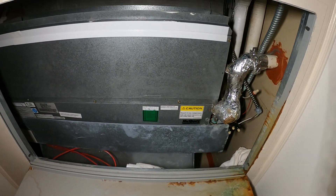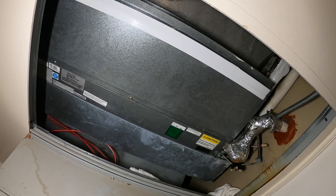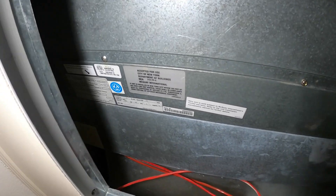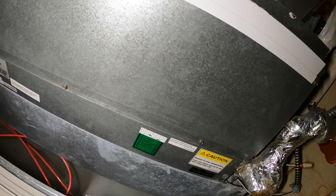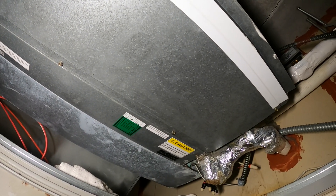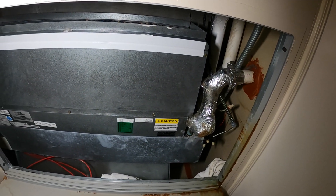We are officially heating and cooling and we're going to wrap it up from here. As for why that wire was burnt — it does have an electrical heater and we might have been pulling quite some amps. Together it pulls about 16 amps, and the tag says 16.7. It looked like 12 gauge wire — I might have gone with 10 gauge for these electrical heaters — but either way they should be okay. We repaired the wires and got them back up and running. I'll keep an eye on it, but these units date back to 2005 and have been running fine. If anyone found this video interesting or helpful, please drop a like, comment, and subscribe as I come out with new videos every week. Catch you all next time.